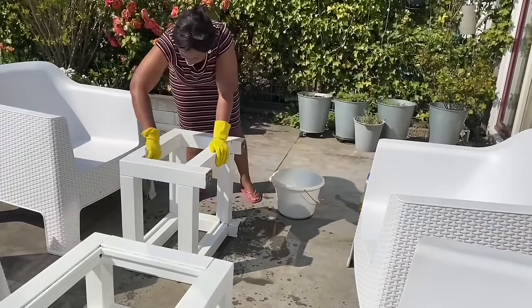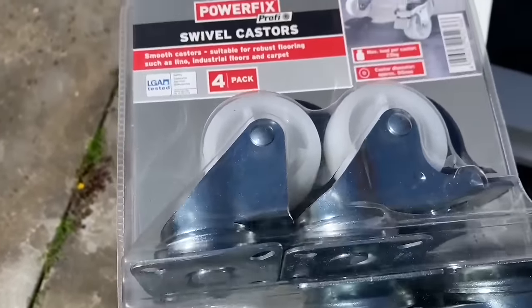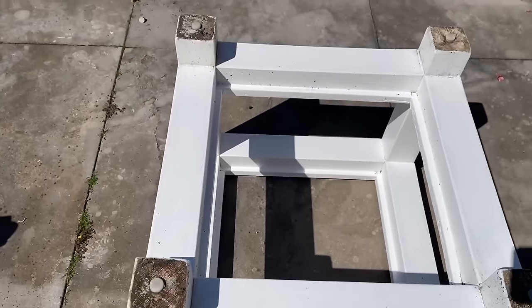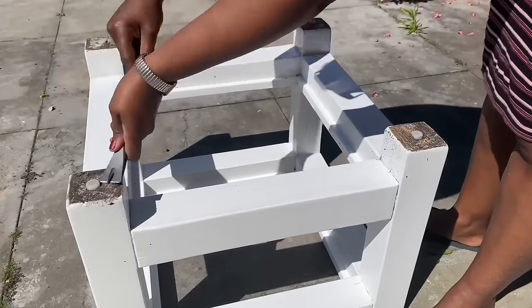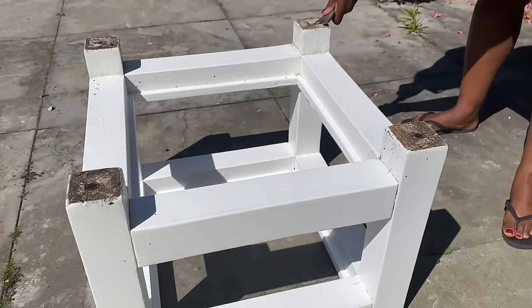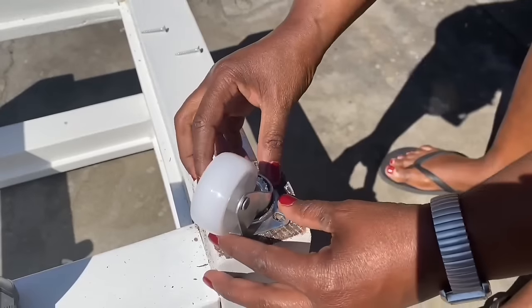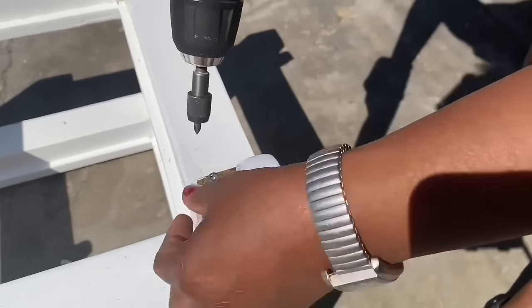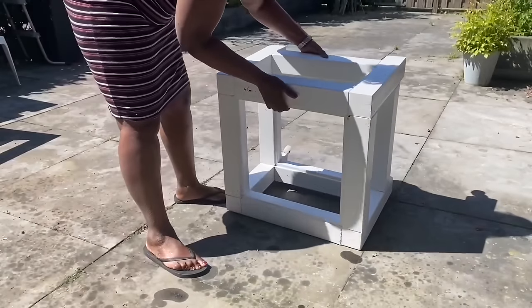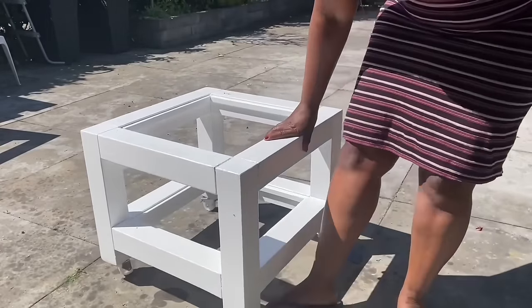Another project I've been sleeping on are these two tables. I've had these swivel casters for two or three years already in my storage. Even though I love these tables they are so heavy to lift and move around, so I wanted to make it easier on myself. It was very easy to install — just two screws to attach each swivel caster to the bottom of the table. The package came with four: two with locks and two without. I installed the locking casters diagonally, and here you can see how easy it is to move around and lock.